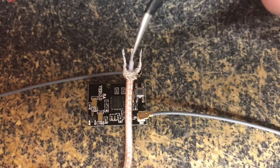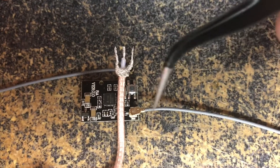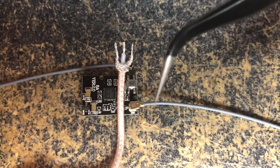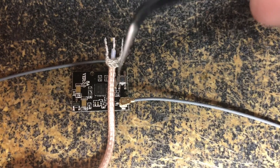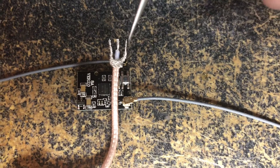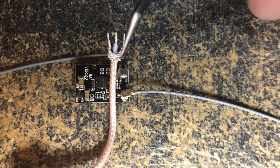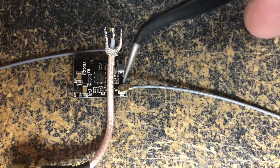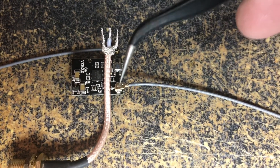This is a much bigger cable than the small one, but it's still the same concept. What you do is you just cut through that outer sheath, then you get to the shield and pull it back - just kind of slide the shielding back, it bunches up, and you make it into two little forks. Just think dinner fork, maybe a shrimp fork. Make it into two little forks, and you can solder this directly to the board if you ever break one of these connectors off. I'm going to pop this connector off right now and show you what it looks like when you kill one of these.